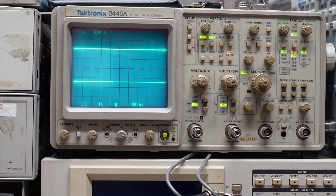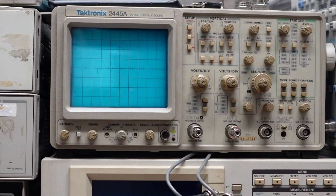We'll take that out of the scope and connect it to my test stereo on the bench. Everything appears to be working. I'm going to shut it down and post this video. In the meantime, I'm going to look through my junk box and see if I can find a 6.8 millihenry inductor. Then the next thing we're going to do is go through the alignment. I want to point out how we got to where our problem was as quickly as we did — you have to think about the symptoms we saw on the front panel.